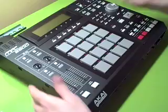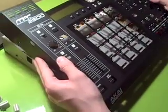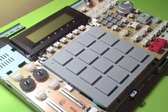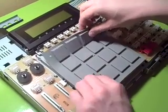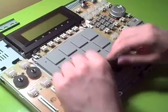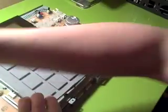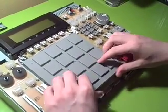Then go around the sides and back — just lean it forward and it pulls right off. The pad sensor underneath is loose; it's not screwed on or anything. So make sure you don't slide it around. If you get dust under there, use dust-off to spray anything away because you don't want to mess up the contact with these pads.